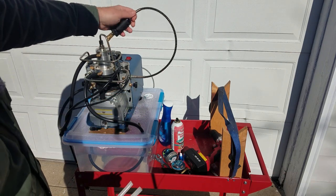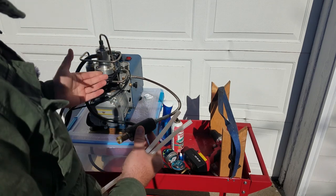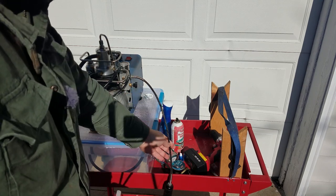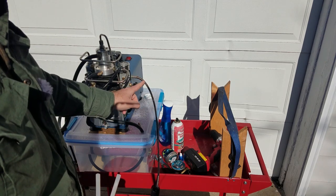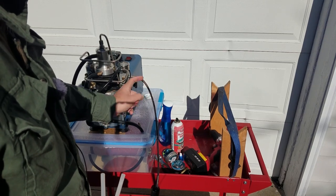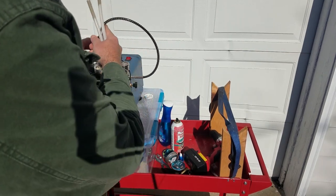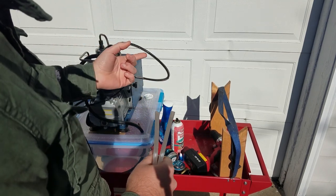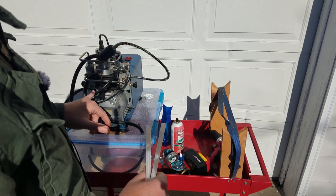I've also had to change out the fill whip. I typically use this on an air gun, but I have acquired some SCBA bottles as well. If you leave the whip dangling down freely, it puts stress on the connection point and can pull the hose off the fitting. My original whip that came with the compressor leaked at that point, so I swapped it out. I make sure not to let it hang freely due to the weight and gravity pulling on the high-compression line.